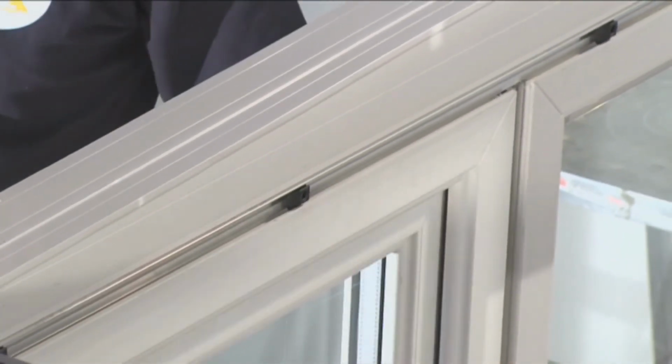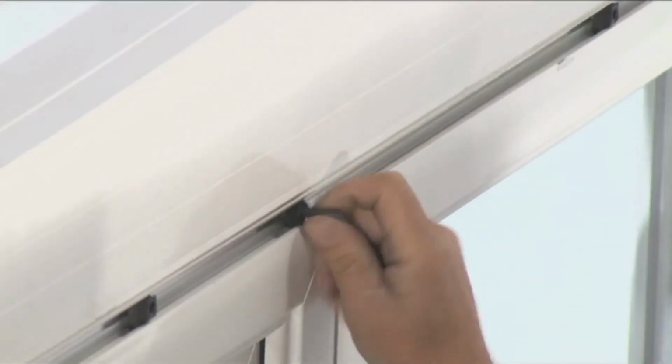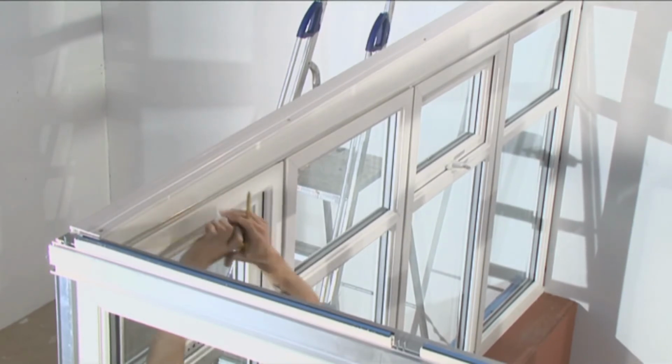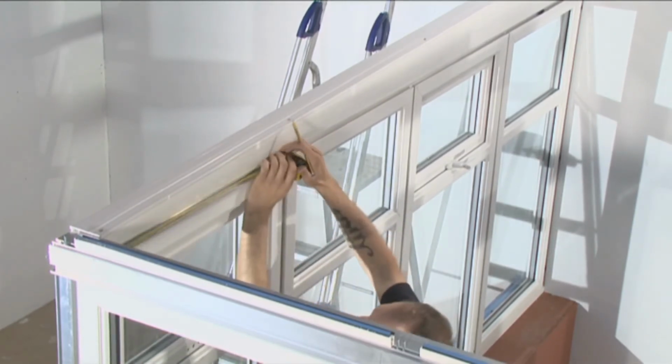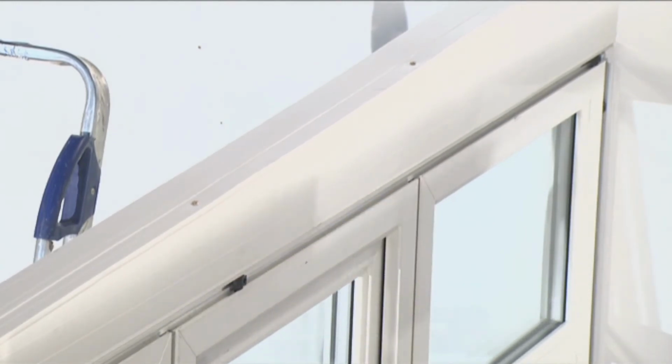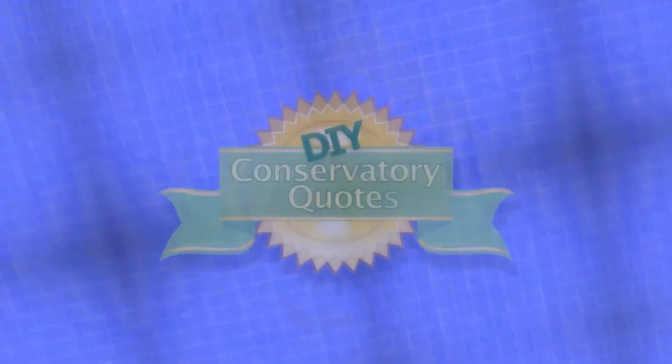Position the quarter-turn buttons horizontally into the gap between the furring and the panels. Turn to lock. Ensure the first quarter-turn button is positioned within 50 mm from the front face of the furrings. Position the buttons every 400 mm along the length, both inside and out.